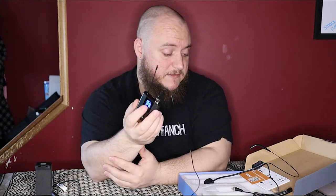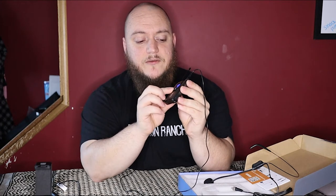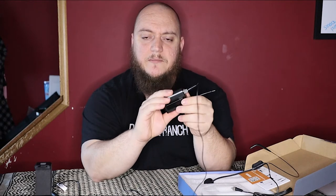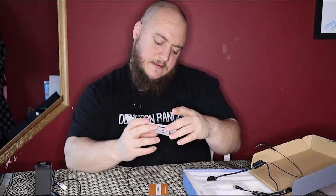The two buttons when you're using it — if you press it, it will come on and tell you the channel that you're on and the megahertz. This is a UHF wireless transmitter. It has 32 channels that you can select through with those buttons. You can also change the volume — if I turn it down, you'll notice I'm getting a little quieter, and if I turn it back up, obviously I'm getting a little louder. It also shows signal bars, like a cell phone, to tell you if it's in range of the receiver.